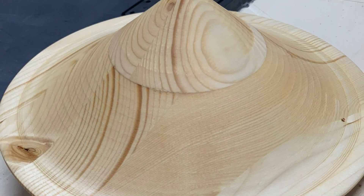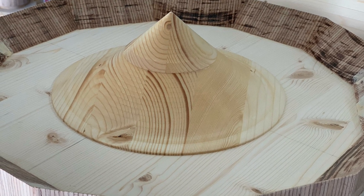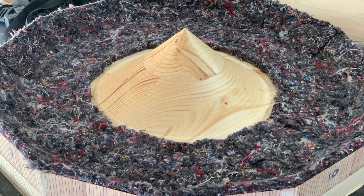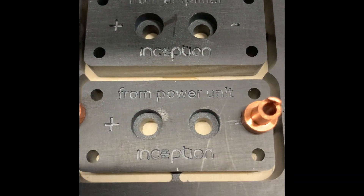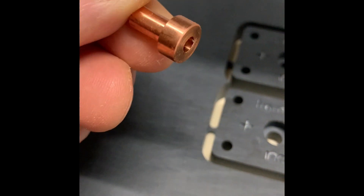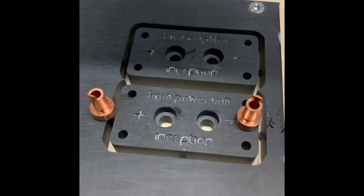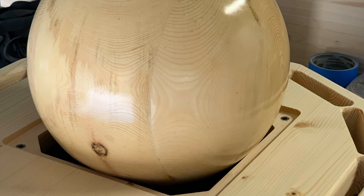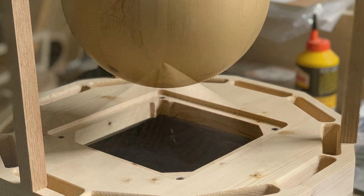The driver, as you can see, is mounted on top in a horizontal position, not directly facing the listener. Although this might seem like a less optimal solution due to the driver's directionality, there is one important exception. In this design, a solid wooden sphere is installed 5cm above the driver and the labyrinth port exit. This sphere acts as a horn and a waveguide, dispersing the sound in 360 degrees. It's better to see and hear once by yourself — so put on good headphones and enjoy the sound.